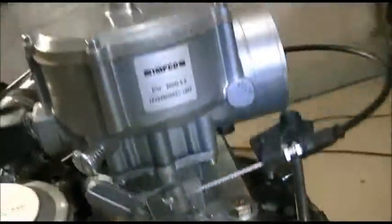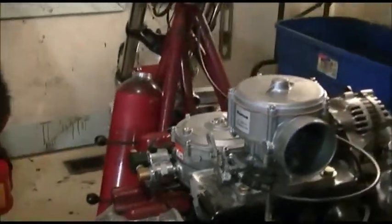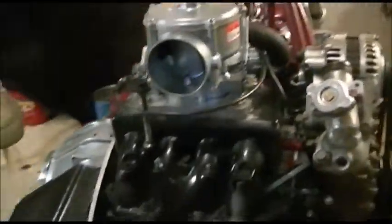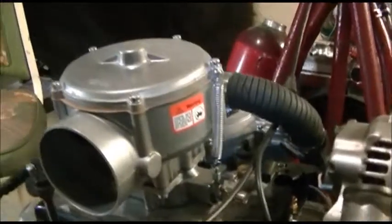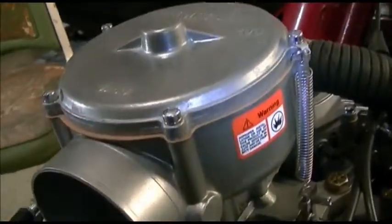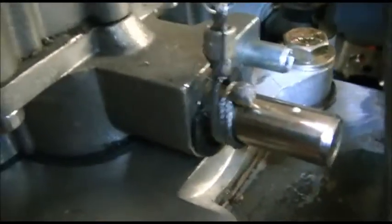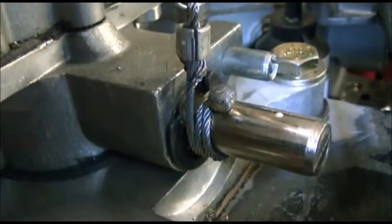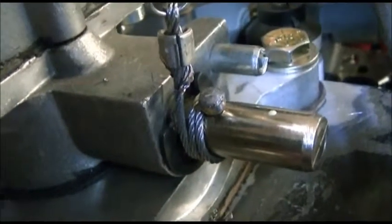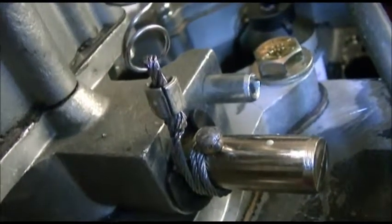I'm really tired of springs. You've got to stretch them out an inch and a half or an inch and three-eighths to make them work properly, and I just don't like them. So what I came up with — I'm sure someone else has done it — I come over to this other side and I have a cable wrapped around this shaft, three wraps. Then it comes back up through a center hole that comes up through the shaft, and I've got a little hand-soldered end on it.